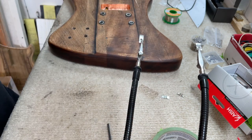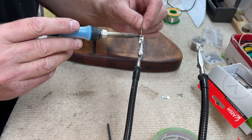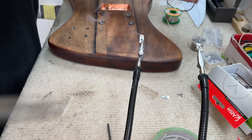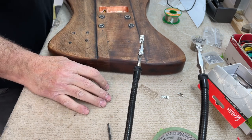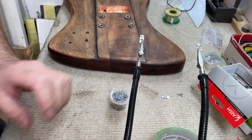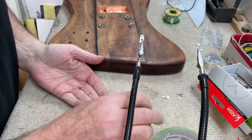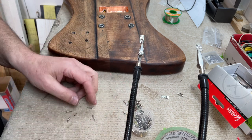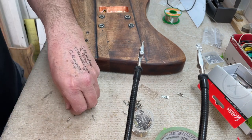So it's a little bit old-fashioned, a little bit agricultural doing this, but it's my way of making sure that the cavities are properly shielded. Clever people sometimes rely on the fact that the tops are touching the copper, which then is hopefully grounded. But on any guitar with tunnels, it's where the tunnels are that runs the risk of wires being subject to radio frequency interference. So you can't really fill in the tunnels. You can sometimes get a bit of the way in with paint, but most of the time you can't really reach very well. So I'm going to put this one down in there